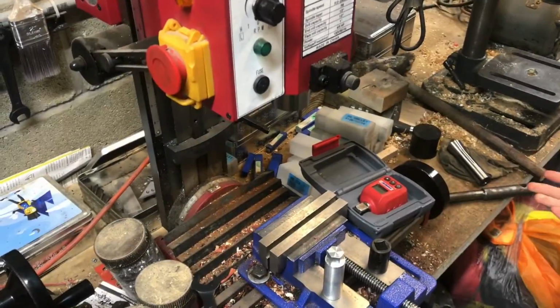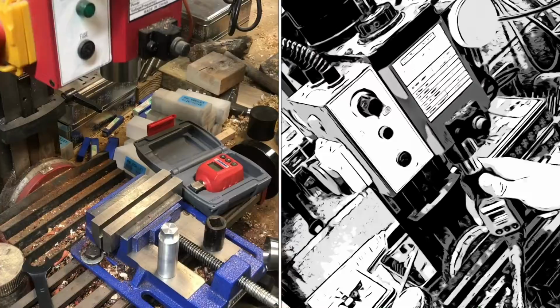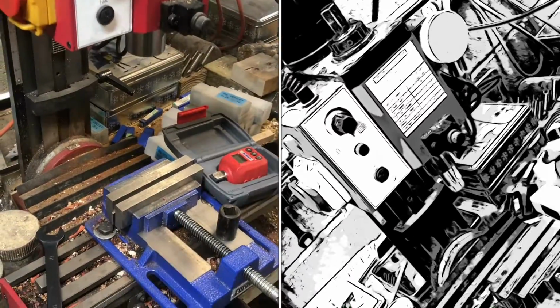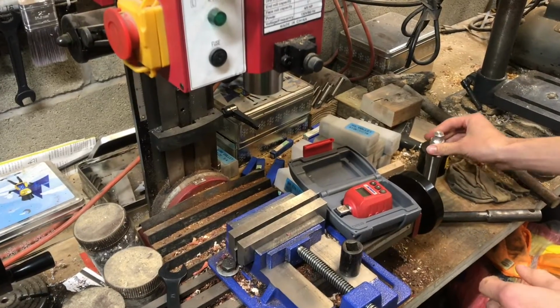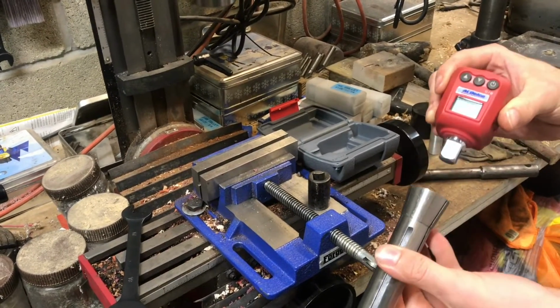I'm going to show you how to do a collet slip test. It will tell you how much torque is required to cause your workpiece to slip in the collet, which would obviously destroy the part or make it useless. Hook up a digital torque meter.